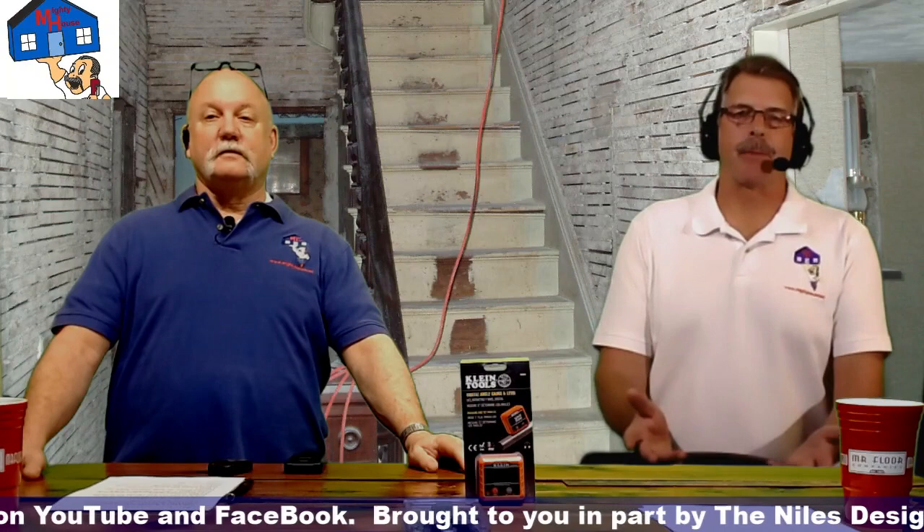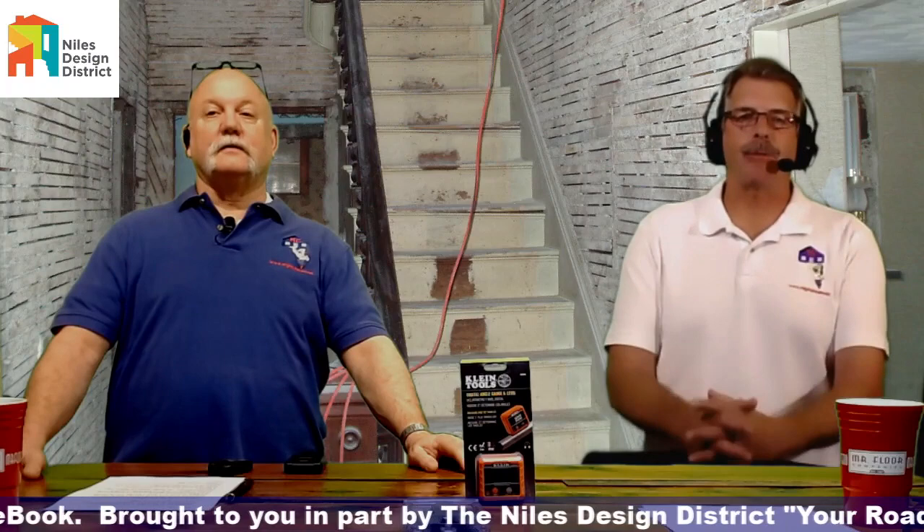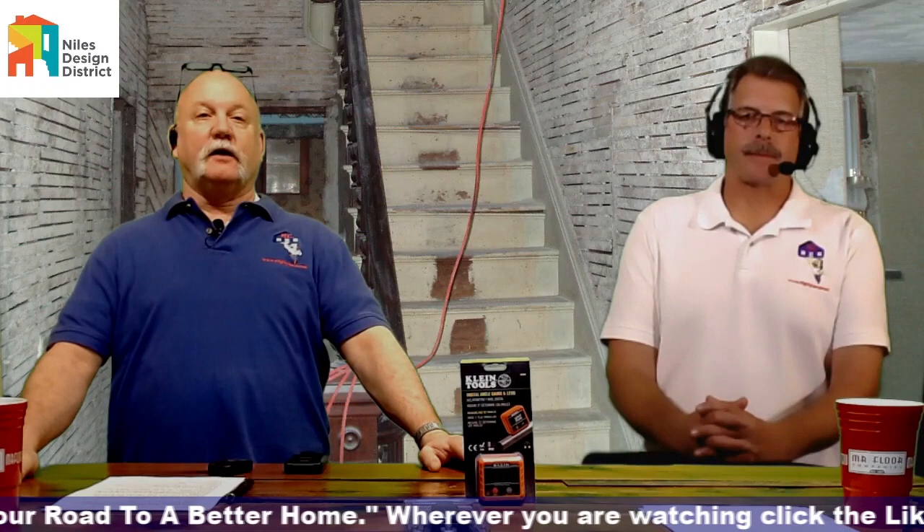In older homes with lead present in wall paint, I wouldn't demo the plaster. A great example is the picture behind us — someone spent a lot of money taking all the plaster off, and now you can see the wood lath. The easiest fix is quarter-inch drywall with contact cement: roll it on the wall, roll it on the drywall sheet, stick it to the wall, then tape it like standard drywall. The room gets a half inch smaller, but it's fully encapsulated.